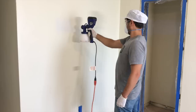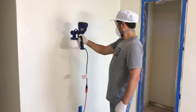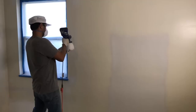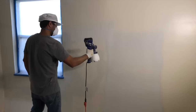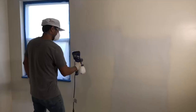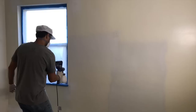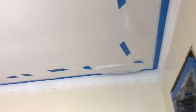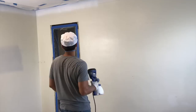It's really important that the path of the sprayer passes beyond the area being sprayed and that you're turning the trigger off and on as you move through the area. You want a gradual paint start through the working area and a gradual turn-off before moving to the next area. Now that we have technique down and our ceiling is painted, we just have to protect our newly painted ceiling from overspray with a little plastic and 3M Delicate Surfaces Tape. Now we're ready to rock and roll and paint these walls.